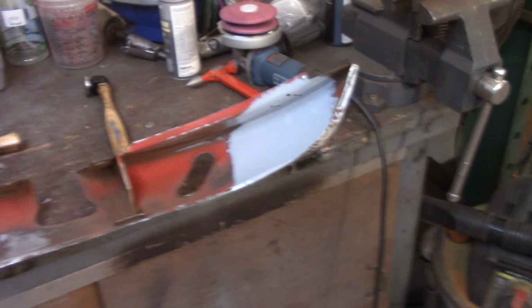So I got all those little wire clips made, essentially just cutting them out of metal, and going to paint them up. So you can see I've got them all on this kind of holding thing here, so I'll get all these, both sides of this, painted with epoxy primer. They all get covered with shrink tubing just to prevent wire chafing or anything, so I'm not real concerned about cosmetically that these look good.